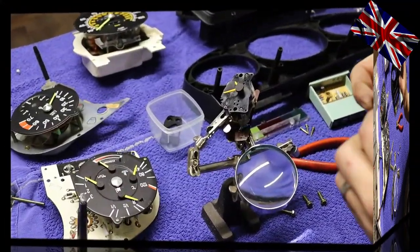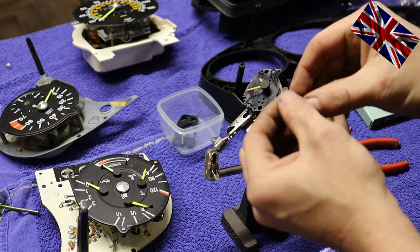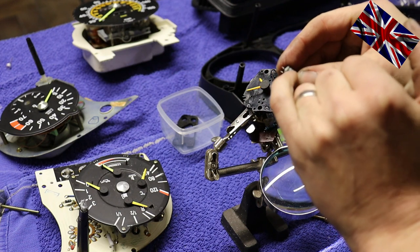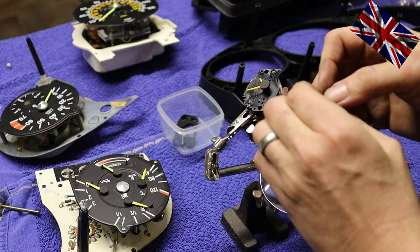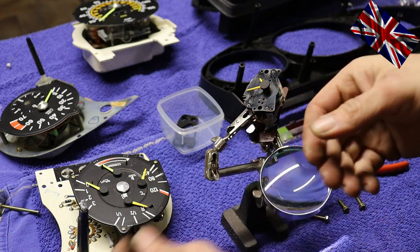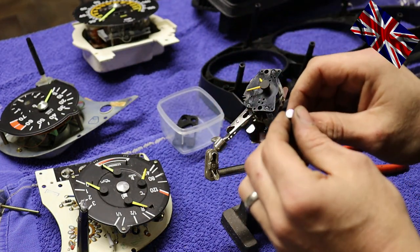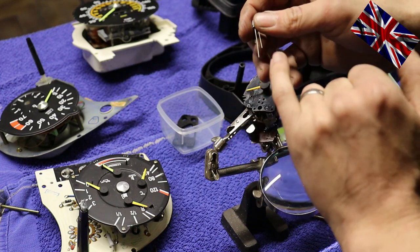The old capacitors are kind of brownish in color and probably shot for sure. The first of the old capacitors, brownish in color right here, looks shot to me. The new ones can take more heat by far. With these capacitors, polarity does matter. The longer foot is always plus.